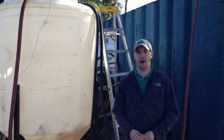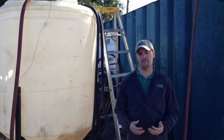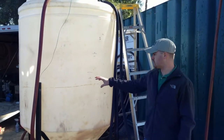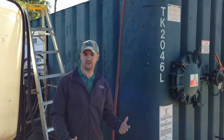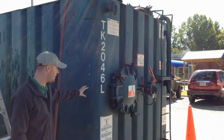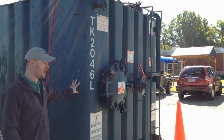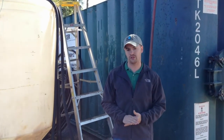The first thing you might want to consider when planning your design is how you're going to store and mix the EOS product you've chosen for your site. You could store it in a secondary tank — anything as small as this 500-gallon conical tank — or if your project is very large, you could consider renting a large frac tank, something 10,000 gallons or more. Both of these tanks can store your EOS and also serve as the vessel you mix with water prior to injection.